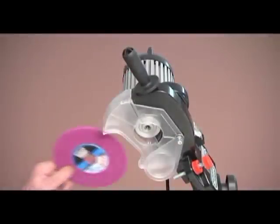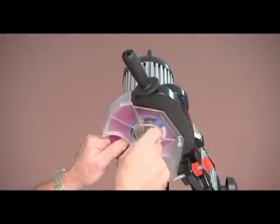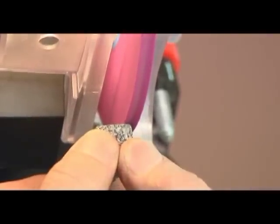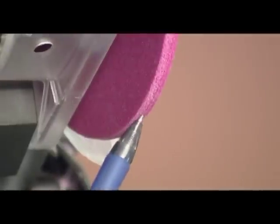The grinding wheel is to be removed. The wrench is supplied for this purpose. Fit the 5/16th grinding wheel and remember to keep the safety shield in place. The 5/16th grinding wheel should be profiled so the wheel will set the depth gauge and also shape the depth gauge in a rounded profile. This will allow the chain to cut smoother.